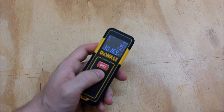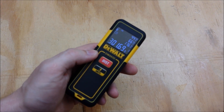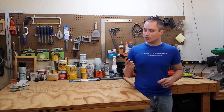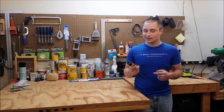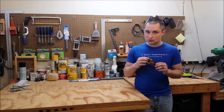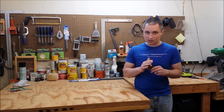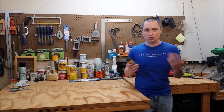The real saving feature of this one is area. Otherwise I really don't like this one that much. It works pretty well if you're just doing area calculations or quick measurements here and there. I don't like that you have to go through extra hoops to get continuous measurement, and I don't like that you have to cycle back through to get to area measurement every time. I'd rather you put it in area mode and it stays there. It is good for indoor conditions with the type of screen it has — the inverse display with the letters lit up, you can read it in complete darkness, which is a big plus over an LCD screen unless the LCD has a backlight.